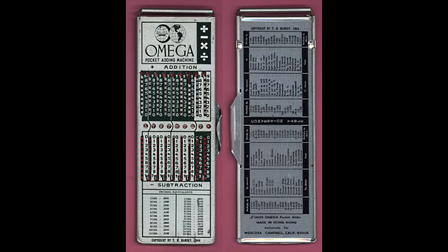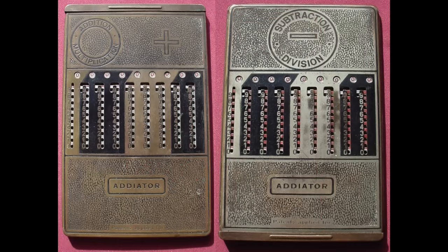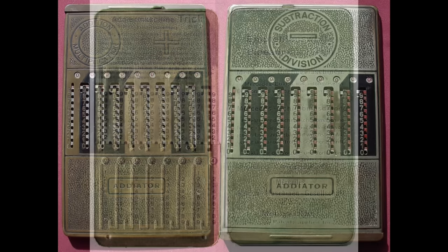There are a number of different configurations of these machines. This one integrates addition and subtraction within a single mechanism, but a lot of the earlier machines had them separated. Some had the addition mechanism on top and subtraction below; some had addition on the front and subtraction on the back so that the answer would show up on the front. Some had a folding shield that blocked one half of the mechanism so you didn't get confused when performing addition and subtraction. This is probably the most compact and elegant version, though a little confusing because you have to remember the rules for both.